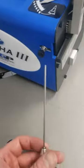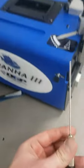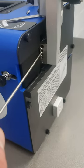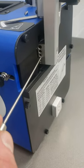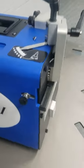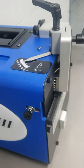Basically what you do is you'll load your tungsten into your pin vise, and when you insert this while it's running you'll be either clockwise or counterclockwise turning it. What you want to do is try and keep a nice consistent turn so you can get a nice even cone. An even cone will give you a more stable, better arc.